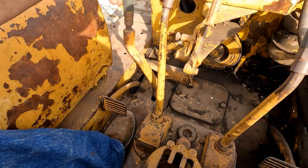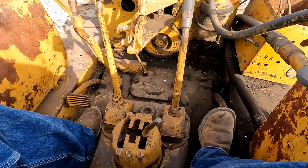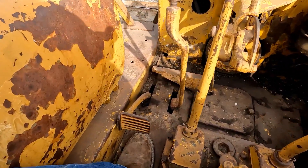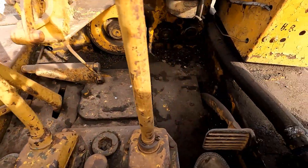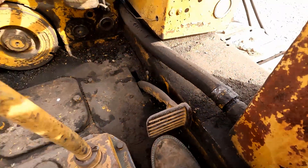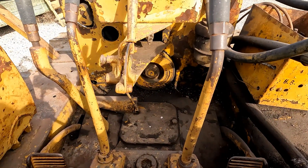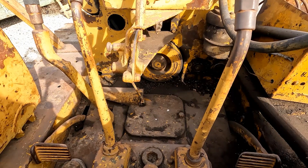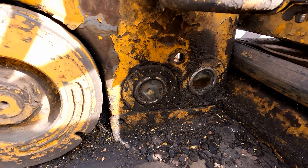The main clutch snaps in nice and seems to work. My dad was steering it with the brakes when it was loaded on the trailer, so they seem to work — they are free. I did notice that these pedals do not show a lot of wear, like you would see on a normal dozer. Although this had a dozer, I don't know that it pushed too much dirt — I think it was mostly silage and lighter material, so that says good things for the undercarriage of this machine.